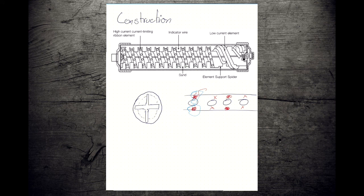So you start out with a fiberglass body, could be fiberboard, and it's arranged in this cross section. Right, you've got this X or this T-shaped cross section, and you're going to take that and wrap this slotted filament all the way around it. So the filament itself looks a lot like plumber's strapping, if you're familiar with it. If you've ever had the chance to see a dot matrix printer from the 80s, it also looks a lot like the edging that came off those printer papers. So you've got this thin filament here. This is like a metal foil, and it's got holes punched in it at a regular interval all the way along.